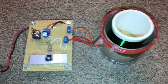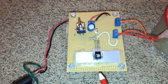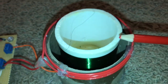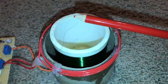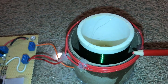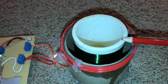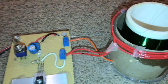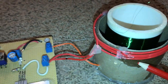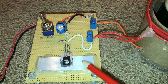In today's episode, I'm going to show you this single transistor Tesla coil that I just put together. It has 40 gauge wire — basically hair thin wire, as you can see here — and it's very difficult to wind. I have about three inches wound on a 2.4 inch piece of PVC. The primary is four turns of 18 gauge wire, and it has one transistor and a heat sink.